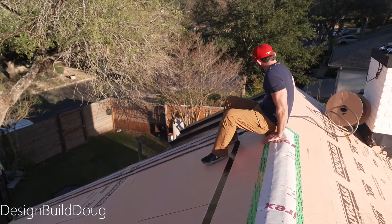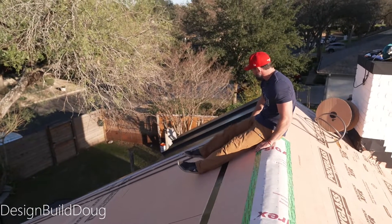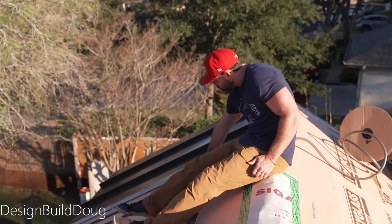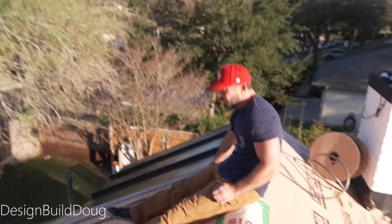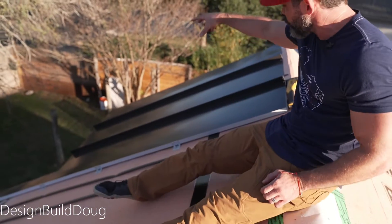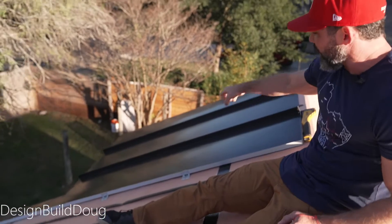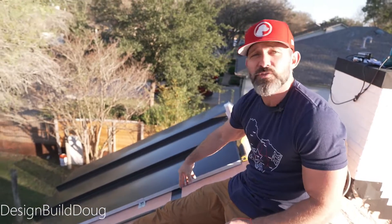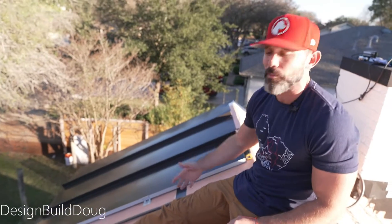So I wanted to try to tackle the avoidance of the oil canning while also elevating my roof off of my decking. And what that is going to do, in theory, if it works — and you can kind of see right here — I have a minimal elevation. That is going to prevent conduction from occurring. So my roof gets hot, and it wants to pass through the adjacent surface, and that heat wants to transfer into my building, putting more pressure on my new insulation.